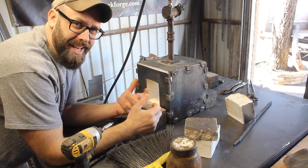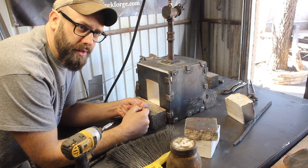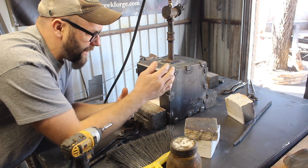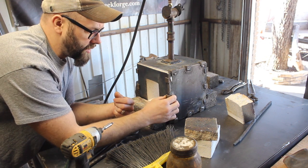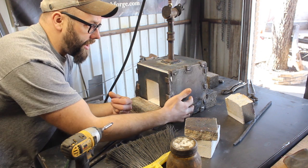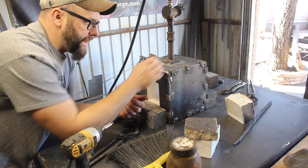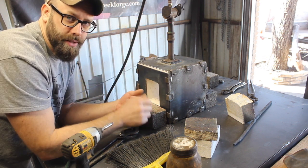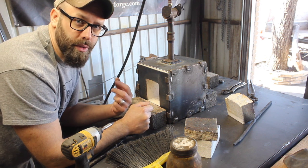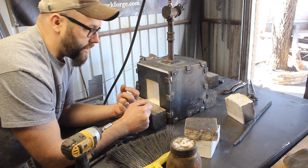But if the bricks are contained and held tightly together, a few cracks really is not a big deal, and the forge functions just fine. So that's what this does. Is this the best way to do it? I don't know, but I used pieces of 3/4 angle iron, tabs basically, welded them on the places that I wanted to have it secure. In the front and back, they'll slide up and out because it's not welded on the front here. And that allows me on some level to replace the bricks when I need to, reline the forge.